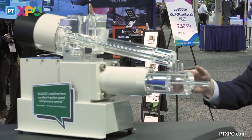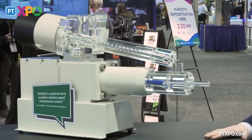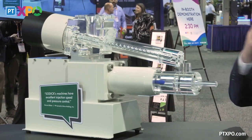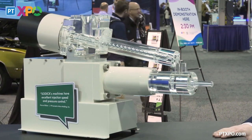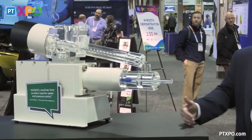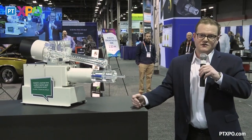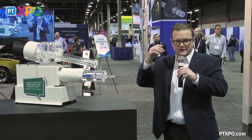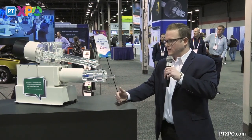And then the final thing here, and this is what I'm going to step over there and talk about really quickly, the topic I wanted to get into was response time. We talk a lot about speeds and pressures in this industry, which is obviously very important, but what we think at Sodick is more important is how fast we get to that set speed, or how fast we get from set speed to 0, slow down and start to pack and hold. We refer to that as response time, or how fast you're accelerating and decelerating.